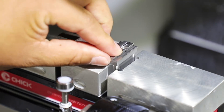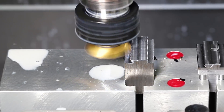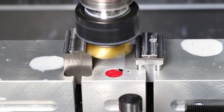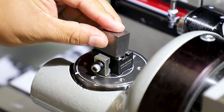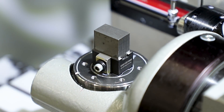The process for getting this part completely done: we take the piece of raw material, load it into the vise, and come in with an angle cutter to create the dovetail shape we need to hold it. Then there's a locating pin on the fixture — that's a locating pin so we know every part, whenever we put it in, is always going to be in the same location. That's a different tool that creates the slot on the part itself, so it always stops in the right place.